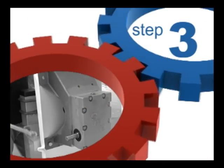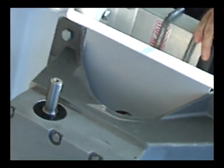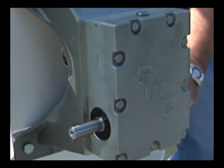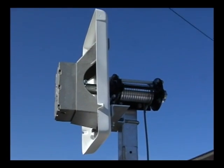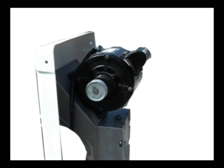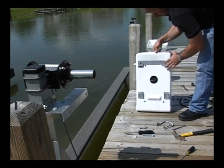Step 3: We are now ready to attach the EBD gear to the output shaft of the cable drum. To ensure maximum dock clearance, we recommend mounting the EBD gear in the upside-down position — that is, with the motor in the up position. The mechanical design of the gear allows for mounting in any direction. With the back cover securely fastened and the wired motor placed firmly on the gear, as mentioned in Step 1, we are now ready to mount the EBD gear.